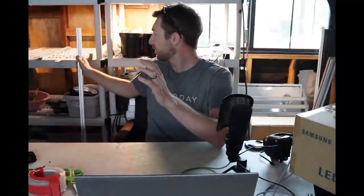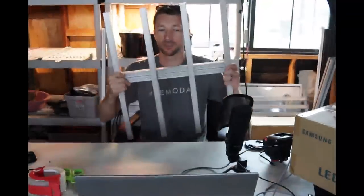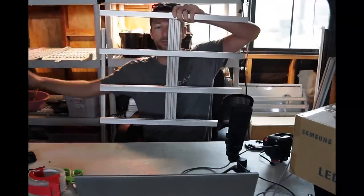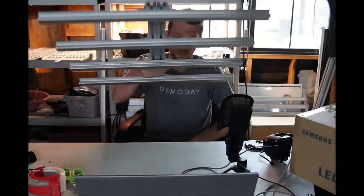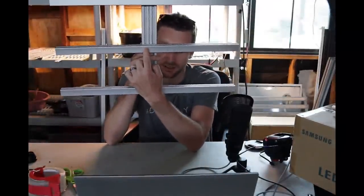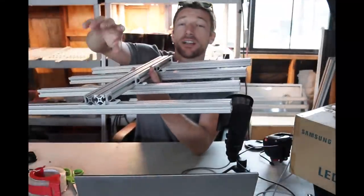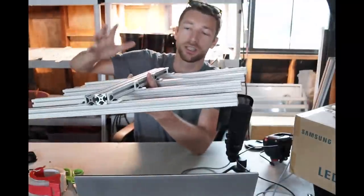On top of that, it is easier to work with. When we did the PLC build, there was a little bit of movement on the heat sinks because there was one pivot point, and a couple of other weak spots in the design. Using these T-nuts profiles as heat sinks allows us to tighten that up. You can see it right here — this is just a little build, but it could be four-foot heat sinks. Instead of a screw up the center as with PLC, we now have two physical locking points with these corner brackets.